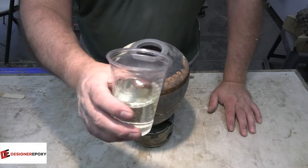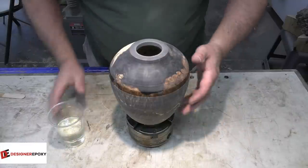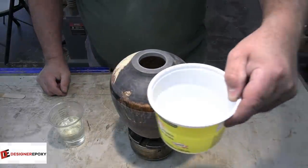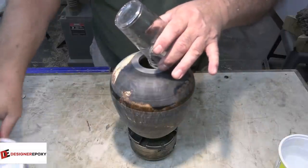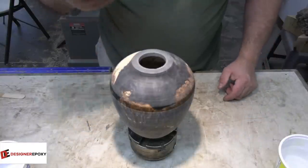I'm going to show you in here - it's cutting very cleanly, no real complaints. I'm going to mix up some resin and do a resin finish on the inside of this piece. I've got some Art Cast here and I'm just going to pour that down inside of the urn to seal up anything that may be questionable - it looks pretty solid, I'm actually very happy with it. I've warmed it up in some water so it's nice and liquidy. I'll put this in, swish it around, flip it upside down for about 10 to 15 minutes, then flip it upright and we'll be able to get at this tomorrow.